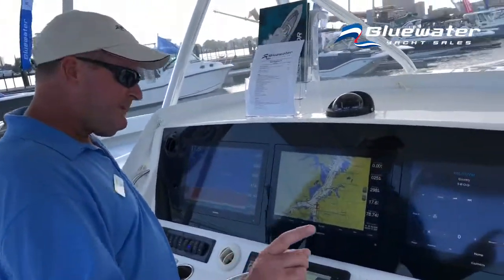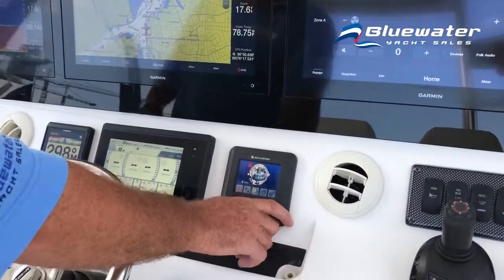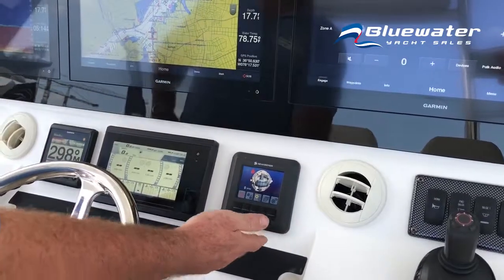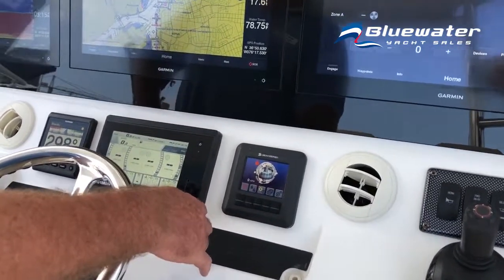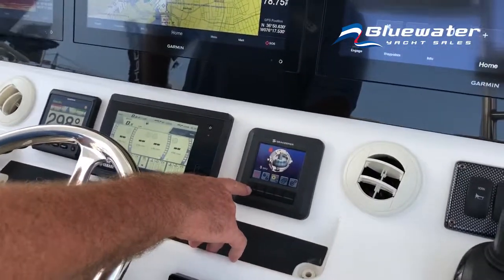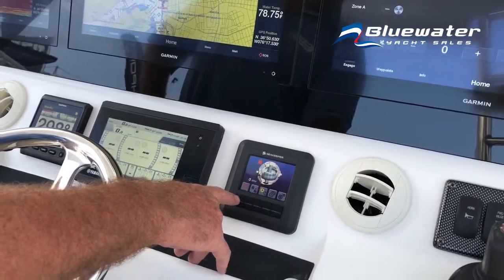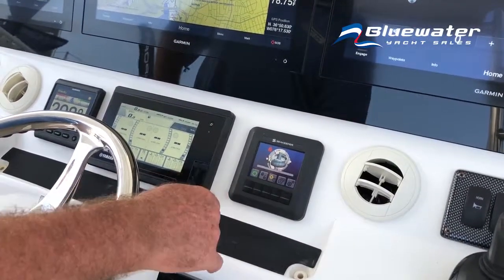Basically, you have the Seakeeper screen here. So I've got the power turned on, the DC power, which illuminates the screen. And there's another breaker at the main AC breaker panel, which turns on the unit itself. And I have one last power button right here, this button here. So to turn the unit on, all I have to do is push it on.